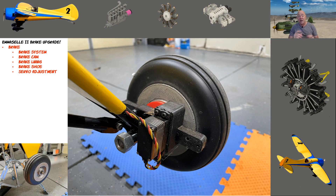Here's what the servo looks like up close on the inside of the wheel. I can go in and adjust the servo positioning and travel to get both brakes tweaked so they engage really smoothly. In my radio, on my finger is the brake channel, but when I move my rudder the brakes are also proportionally engaging. So I can come to a stop, hit my brakes, let off, go full right rudder — it locks up the right wheel — then add power and pivot right on that point. You may have seen that pivot in some of my drone follow videos.